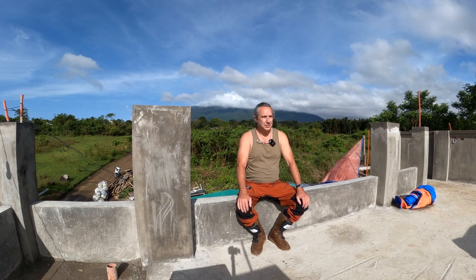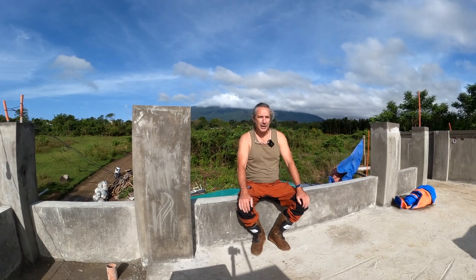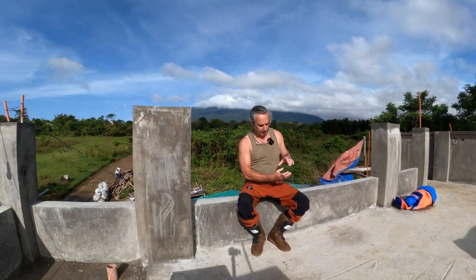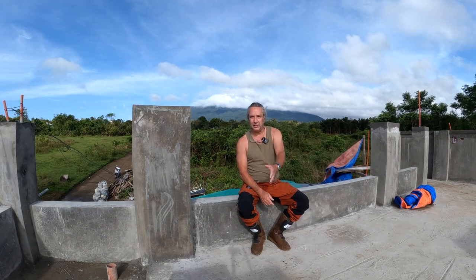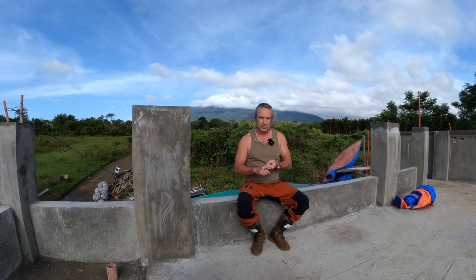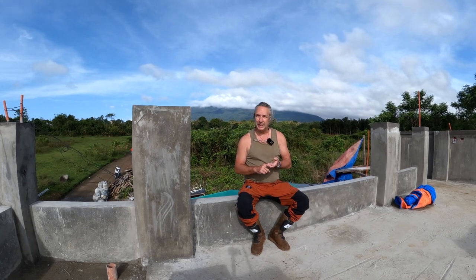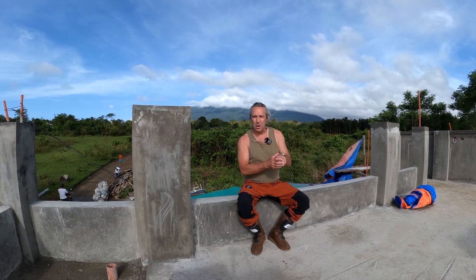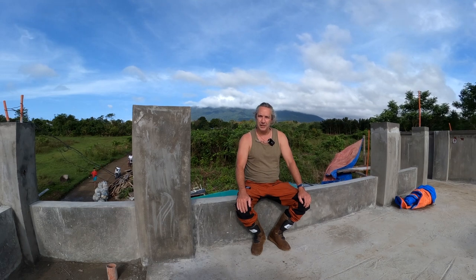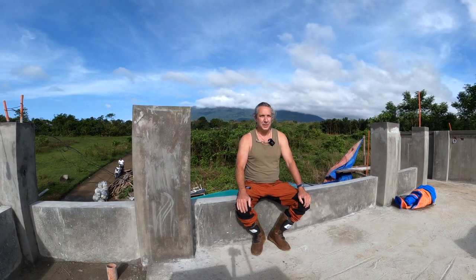But it's going to be about 18 inches to 24 inches deep and probably 18 inches wide, and it's going to be a reinforced concrete box that will also encompass the drains that we have coming off of the building. So we'll have our storm drains, our French drains, our sump pit drain, as well as the outlet for the septic tank. They're all encased in the concrete wall of the box culvert. So the box culvert is kind of our first line of defense from any kind of water inundation from a heavy rain or typhoon. The second line of defense is going to be my sump pit that I'll show you.